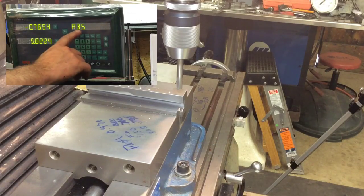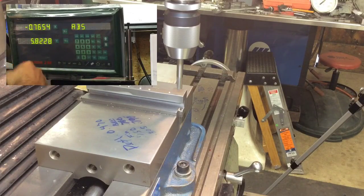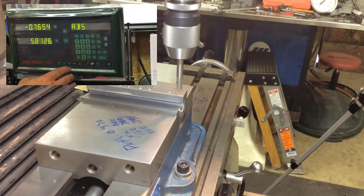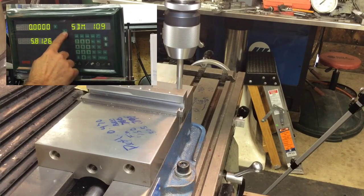I'm going to the points in absolute mode, and I save the point and set it to zero on the point — that memorizes it. Then I go back to ABS mode to go to the next one.